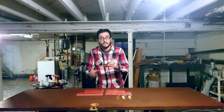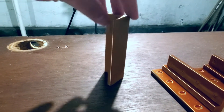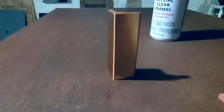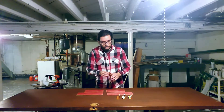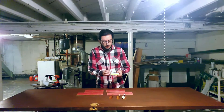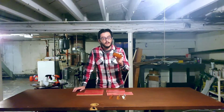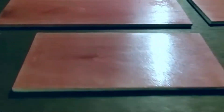First off, we have these 3D printed pieces with a silk copper PLA printed on my Prusa i3 Mark III. They're little triangle pieces with a square in the middle, making each side slot in and get glued on — making the internal dimensions exactly eight and a half by eleven inches, which is a normal piece of paper. They have little circles in the corners of the slots to give more surface area for when they're glued with epoxy to the wood.